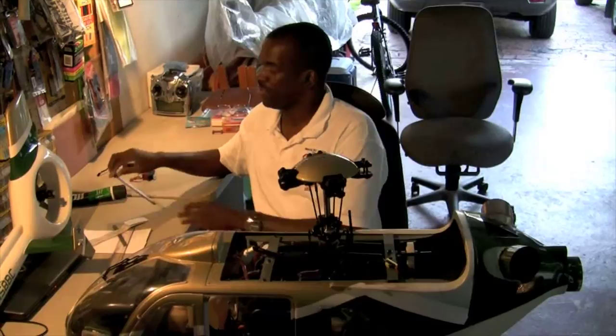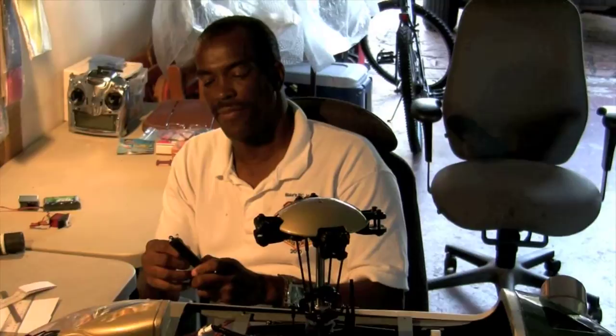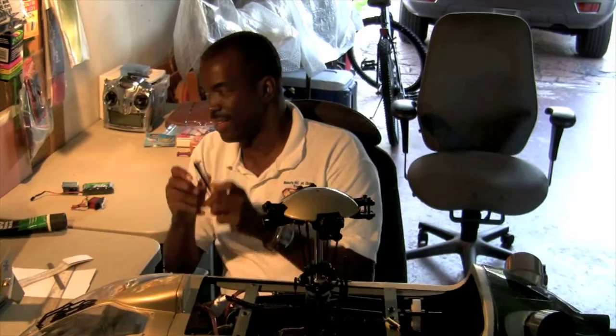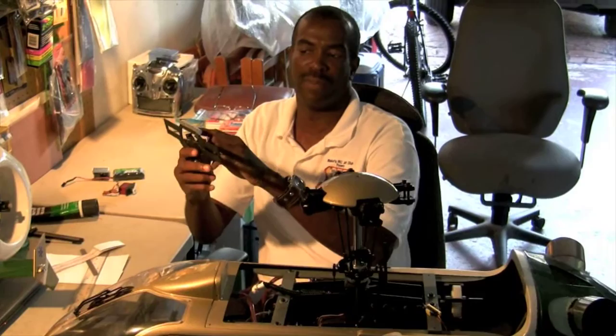The other thing you want to use is a pitch gauge — actually a pitch rod. What this does: if you get one side set with the blades at negative two degrees, once you put your pitch rod and get it at minus two degrees, you can actually measure it on this rod and do the other four rods the same — exactly within two centimeters of each other — so you get it really close. This is a miniature aircraft pitch gauge. What I did, I went to Home Depot, got a $3 level, and I put the level on here on top. That way when I do the pitch, I can see when the blades are level — easy setup, making it more precise.